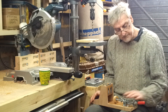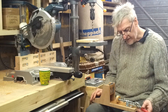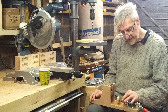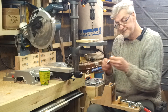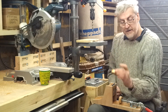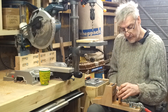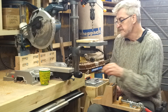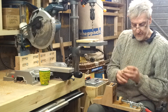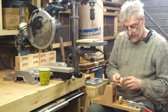This toggle clamp was bought from the internet, around about £8.50. The screw that was delivered with it got replaced with a coach bolt and wingnut. I manufactured the stopper to clamp the work on the end out of a piece of pine. The coach bolt goes in, with a nut backing it up — works a treat.